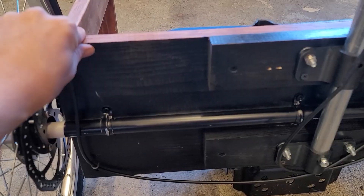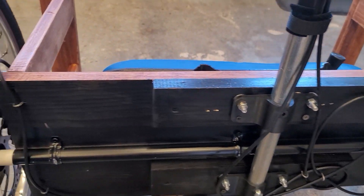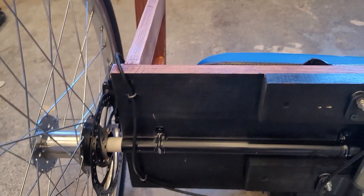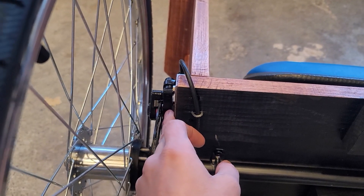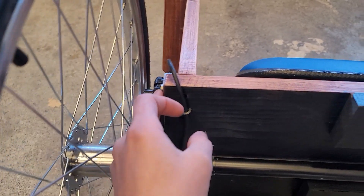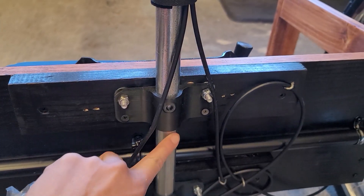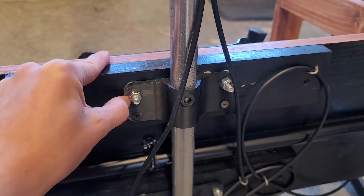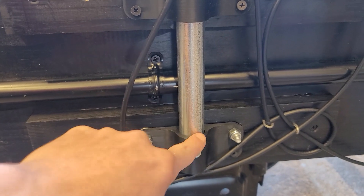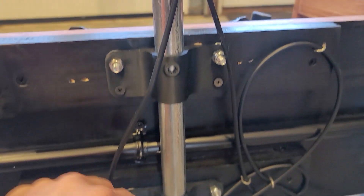This is a 1 inch by 12 inch by 4 foot board cut down to approximately 28 inches. Once I got the wheels mounted on the axle I measured the spacing to put the brakes in and line everything up, and that gave me my board length. Furring strip on either side allows the shaft to be mounted above or below the axle depending on whether you're sitting on it. These shaft brackets are also parts we designed and 3D printed, with one hole drilled through the shaft to keep it from pulling out.